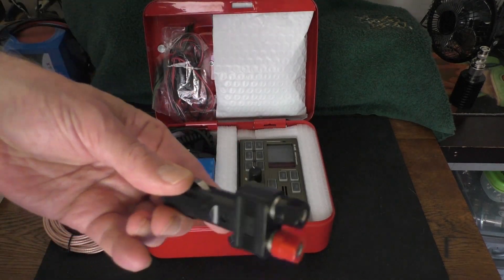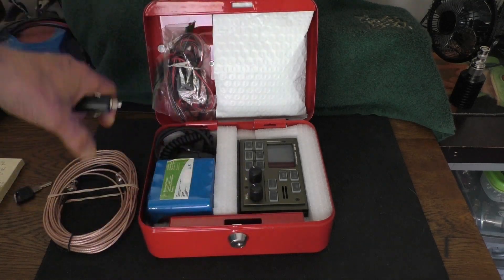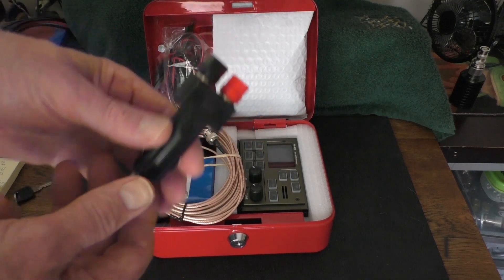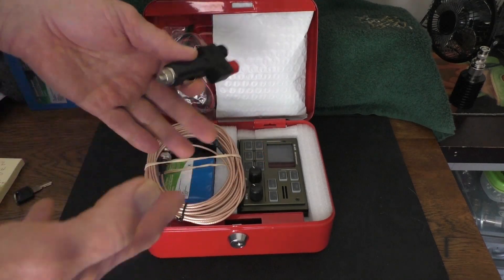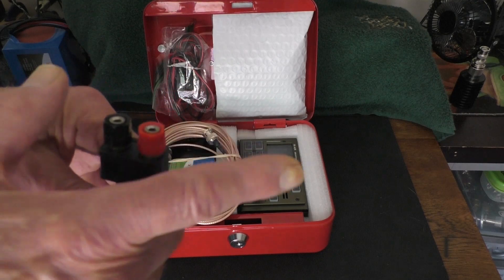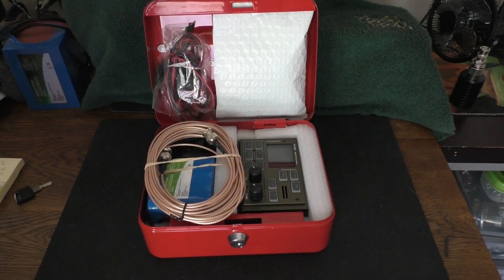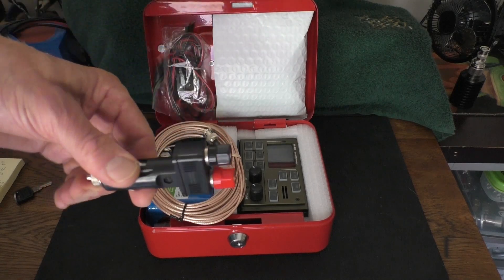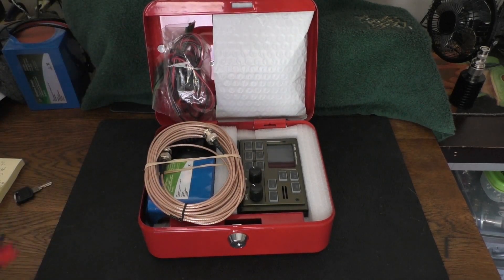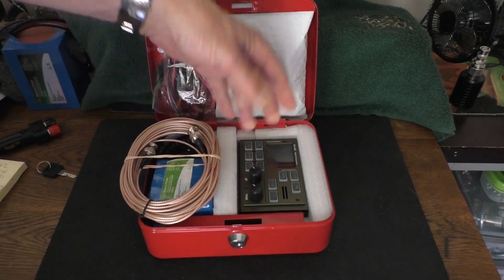Another idea instead of the Pactenna: you can get a BNC adapter, hook it to your coax, and hang it at a high point on a pole. If you get lengths of wire — something like lamp cord, maybe 16 feet per side — you've got a 20-meter dipole that you can tune exactly to the frequencies you want to use for single sideband. Something like this will easily fit in the box. That's all you need to get on the air from this cool little box.